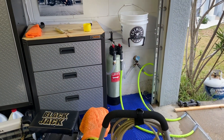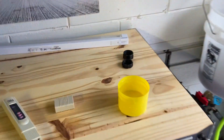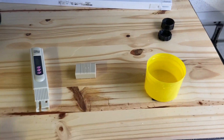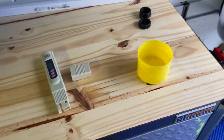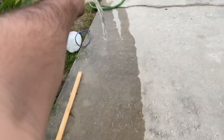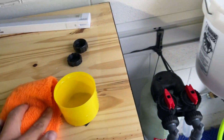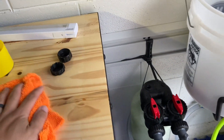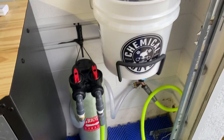That's it — I just wanted to show you the levels. It was 163 on the water coming from the house and then zero total dissolved solids from the filtered water. That's with a brand new meter, all one take, so you know it's actually working and doing its job. When I wash the car now I don't notice any water spots, even if I let it dry on its own. Very impressed with the unit — worth the money. Thank you for watching.